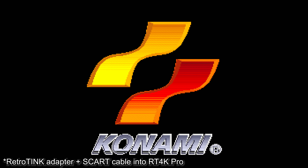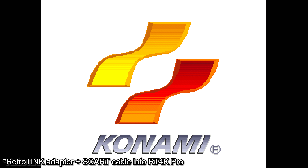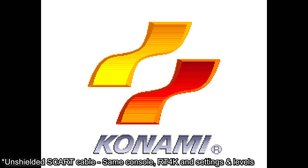Let's switch over to audio testing, and I'll start with my favorite real-world example — the all-white logo that plays at the beginning of Konami games. Let's listen to the RetroTINK adapter with SCART cable first. Then let's listen to the same thing through some unshielded cables, and pay attention to the background hum after the sound effect finishes. You should be able to hear that even through cell phone speakers. The unshielded cables had a lot more hum while the logo was still up after the sound effect played than the RetroTINK cables. But hearing-based tests are often subjective, and MD Fourier analysis is not, so I used that to run some comparisons.